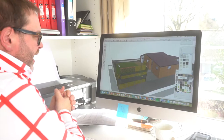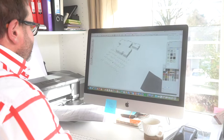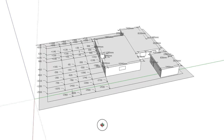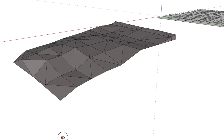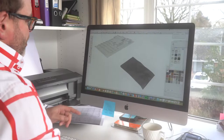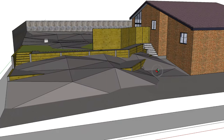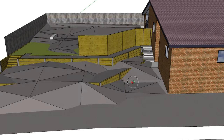I performed a topographic survey of the site. We've referenced the corner of the property where it strikes the ground, and then gone plus or minus in millimetres on a grid. From that, I've plotted the topography of this garden space. What we'll do now is morph this topography over my existing design. There are obviously high points and low points — the low points are underneath my drawing and the high points are above my design.